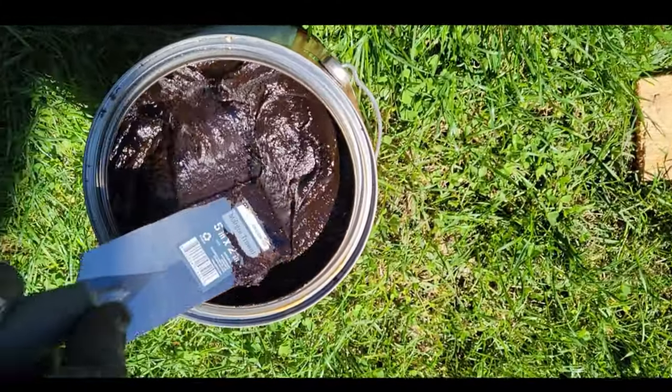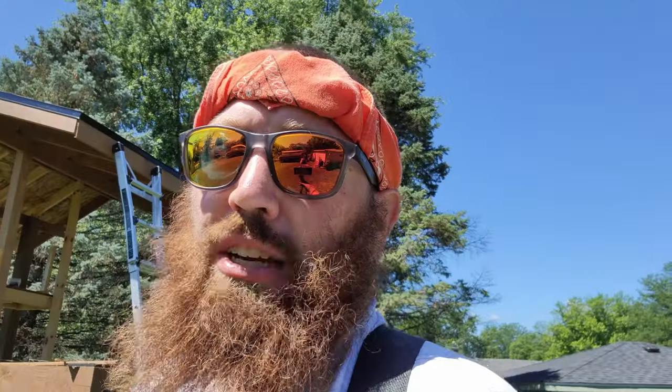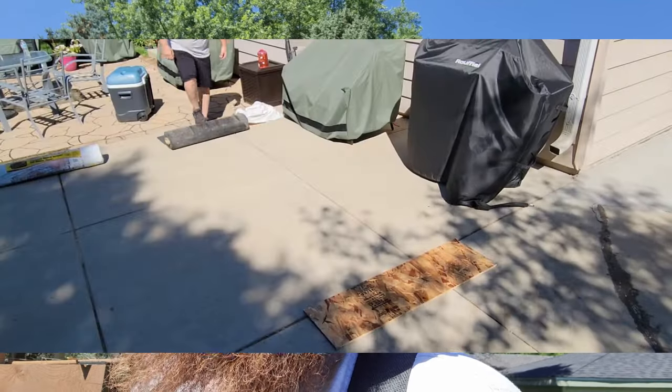So I got the cement — asphalt roofing cement — which is some pretty nasty stuff. Going down the edge, nailing it on the short side and then rolling it across, nailing on the top. They say every 10 inches. I'll be going every 12 inches so that I hit every roof rafter and midway between, and then I can cut off any nail that poked through. That way there's less nails that could schmuck someone underneath. So let's go up there before it gets too hot — it already is hot.